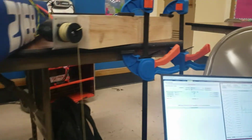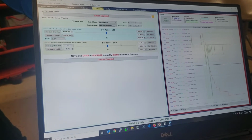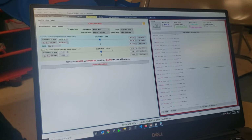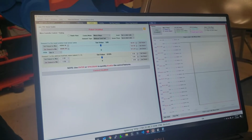Anyway, so playing around with using the arbitrary feed forward term. Basically the output of your controller will always be some negligible value, right? So that value you would pick to overcome the external force. It's how much voltage is required to counteract the force of gravity. So that was empirically derived.